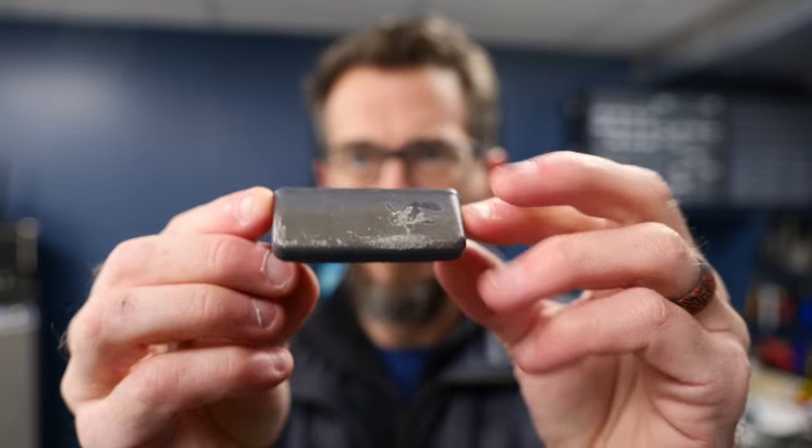This is the piece that we actually need to recreate. This is the one I took off the passenger side — we can 3D model this, then mirror it, and we'll have one for the driver's side as well. Anytime you're going to 3D model something for the real world, you have to be able to fully describe that thing. You have to write down the outer dimensions, but also the thickness, how that thickness changes from top to bottom, the size of the holes, where the holes are in relation to the outside edges. Those are all things you measure with a pair of calipers and write down, and then you can take them into 3D modeling.